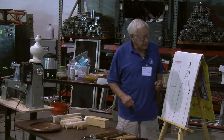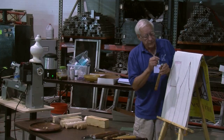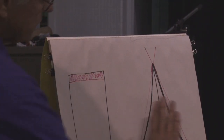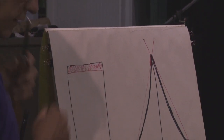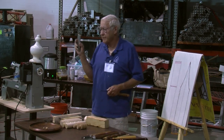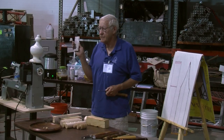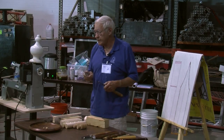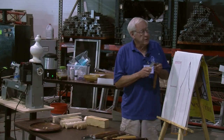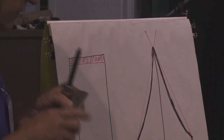when we go to sharpen this thing, if we look at it this way, we want to touch just this little bit of an edge here. This is rotated 90 degrees. And if you do this right, and I've converted myself, this is a diamond hone. I'm really convinced that this is the only way to go. They last forever, and they sharpen things really fast. So what you want to do is touch just the end of the tool here. That's the sharpened edge of it.